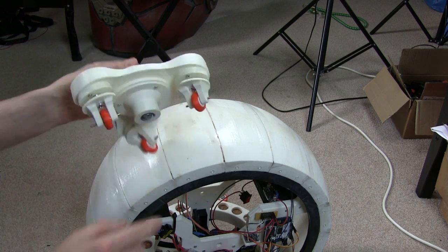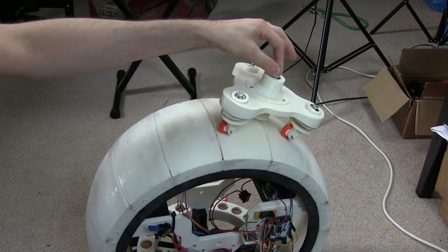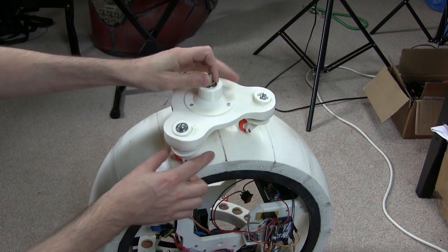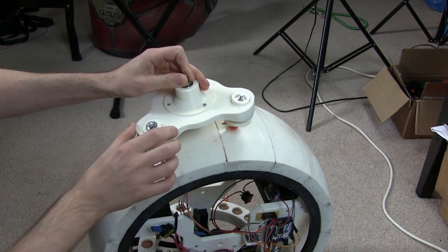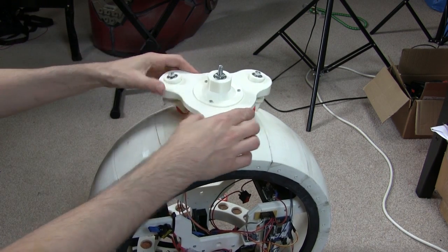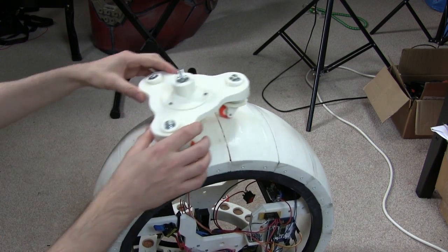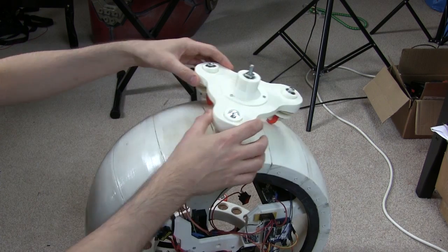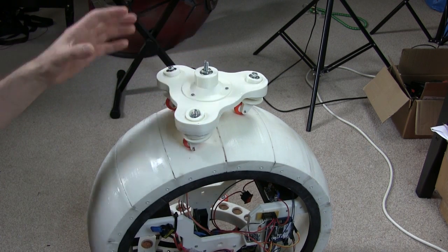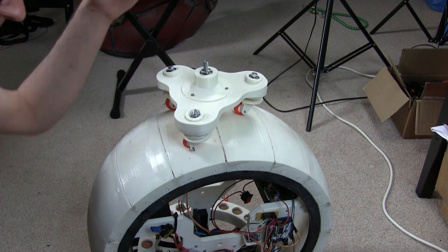So now I've got these rubber wheels on, it's quite smooth moving, but you'll notice that it has a tendency to rotate as I change direction, and that's because the casters want to swivel round on the bottom, which causes some rotation in this as it goes. So obviously this can rotate around, so for head rotating that's no problem, but for changing direction it puts additional friction on, and I want this to be as smooth moving as possible so the head doesn't lurch along as it goes and doesn't cause too much friction, slowing down my dynamic stability that I've already implemented.